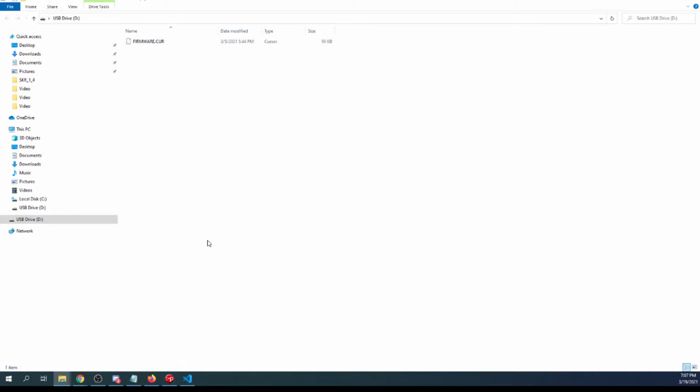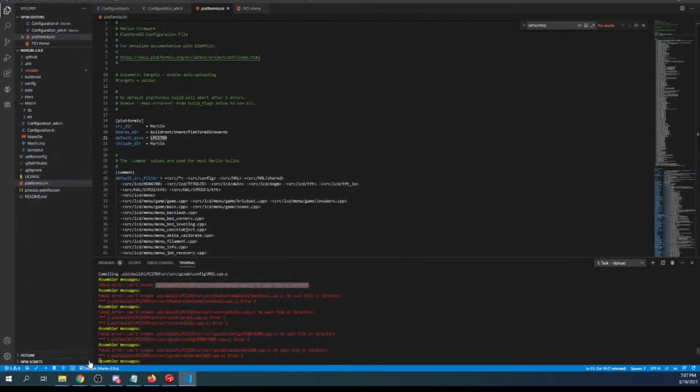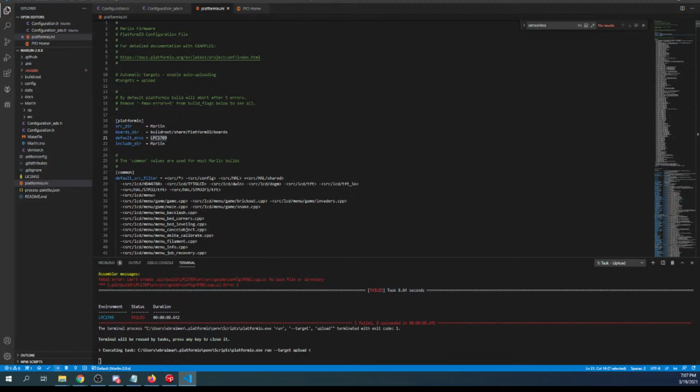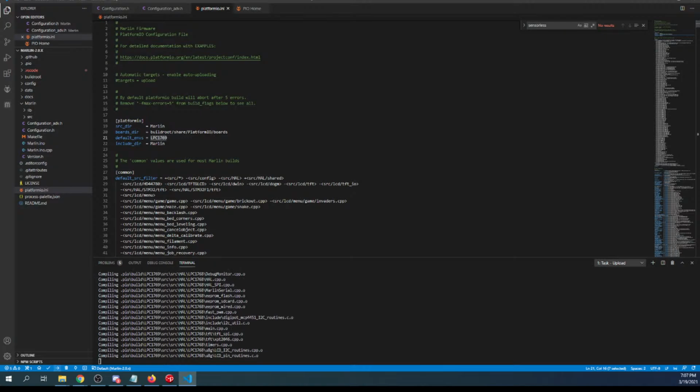But it might think that we're using a different connection, but I doubt it for Pronterface because we disconnected that. So I'm going to do this. I'm going to do a clean. Sorry, I run through a possibility list out loud, which is my way of thinking about the problem for you. So I'm going to rebuild again. Now there may have been some junk from a previous build in the .pio. But if it fails again, then I've got to go to Pronterface and shut it down and reopen it. But I don't think it will fail.